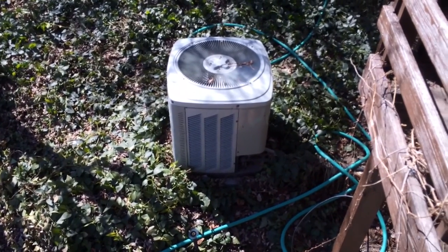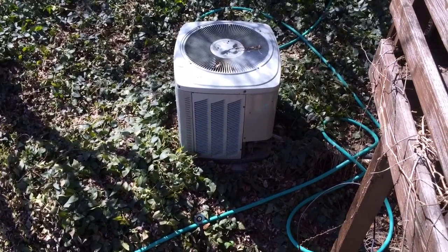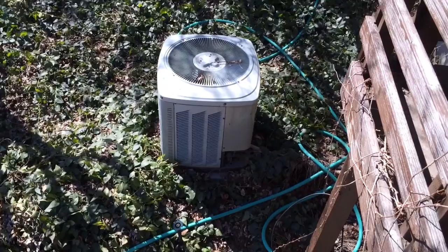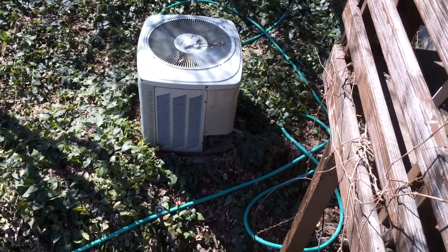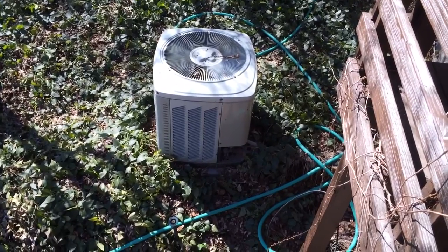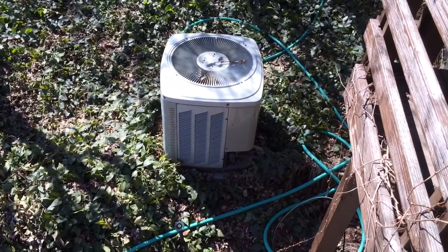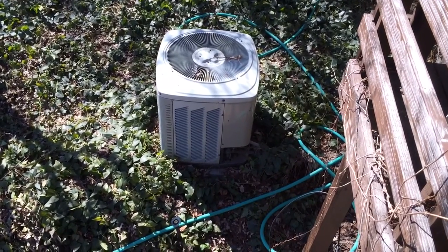This is the current air conditioner they have. We're going to keep it. Nothing's moving. But the coils on this are so plugged up that we have to do something to it. So we're going to strip the sides down. It's a spine fin coil. And we're going to just acid wash the entire coil, get all the gunk out of it, wash it up really, really good, make sure it's perfectly clean, and then put the coils all back together on the condensing unit.